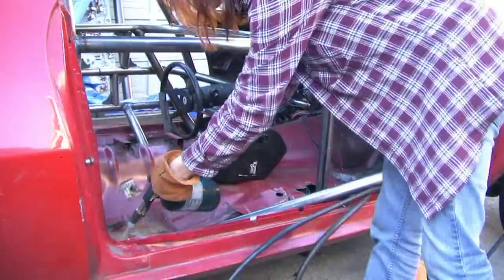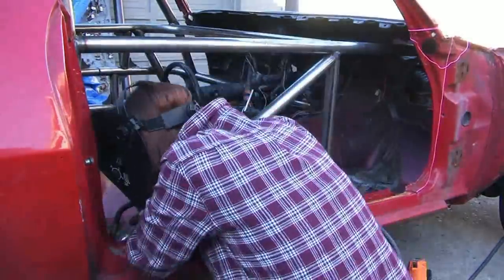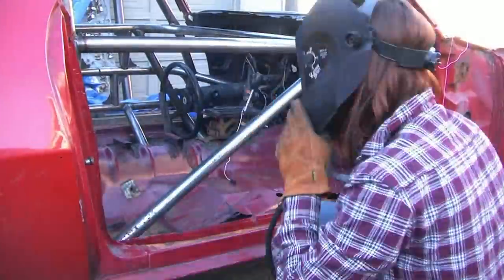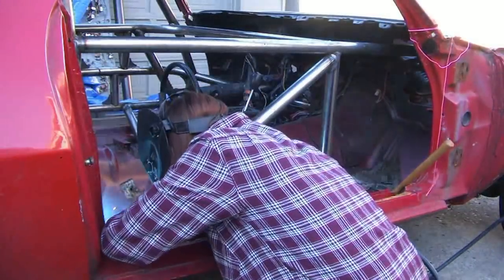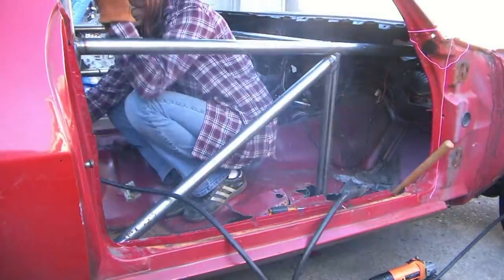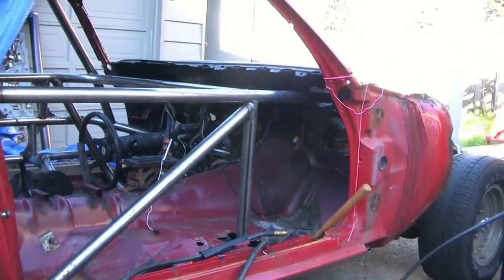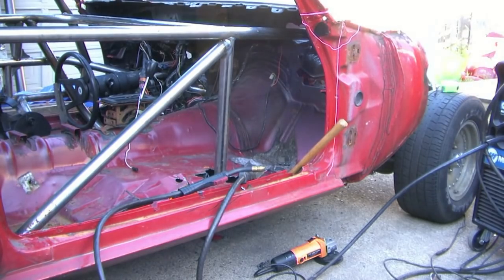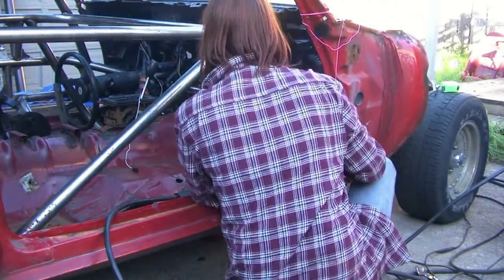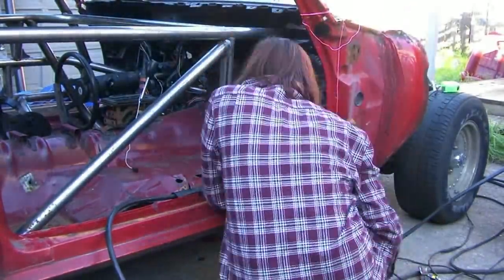Down in the lower left corner, I'm getting a little bit of free gusseting by cutting the tip of the pipe off so I'd catch the roll bar that was going up and the subframe brace. I'm also bringing the upper right close to the horizontal brace that goes forward so I can tie the door bar and the brace together with this diagonal brace. Now I'm relieving a hole in the floor so I can bring a diagonal up from the subframe.